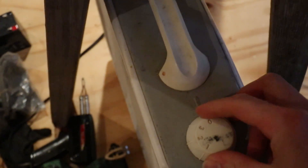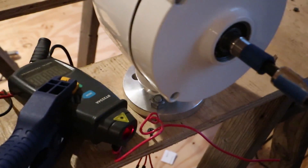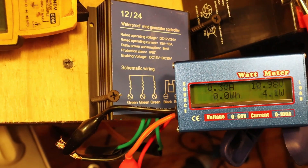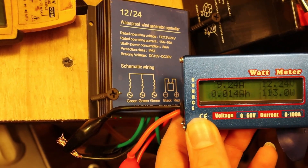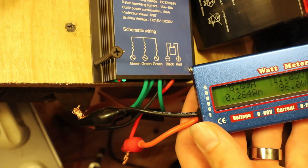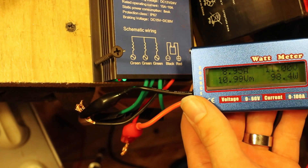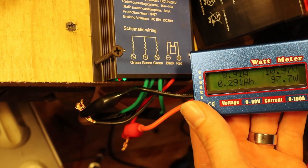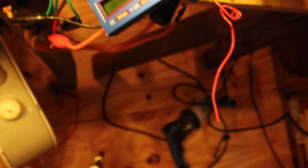First I'll turn the fan on. Turning it to speed three, you'll see my voltage has dropped to 10.97 volts — let's get this power out before the inverter hits that too-low cutoff. With the fan on high, we're at about 11 volts and generating about 95 watts of electricity. I'm going to pan over now and show you guys how fast this thing is spinning.